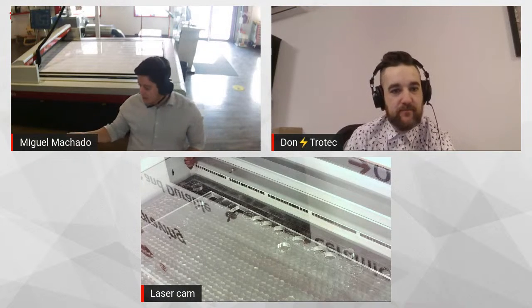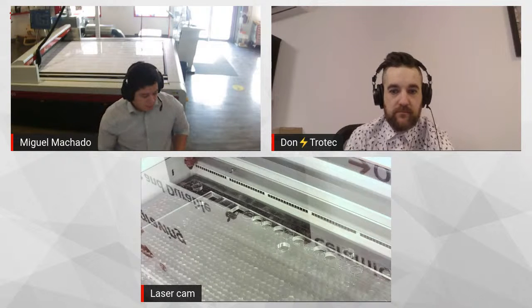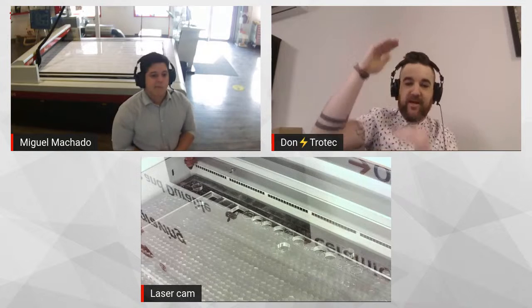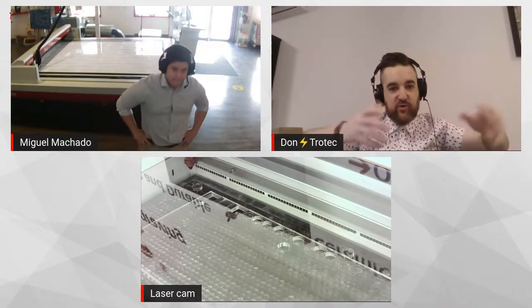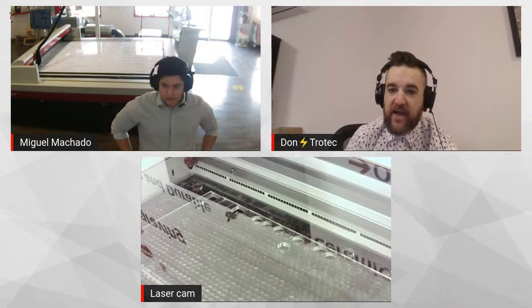If you're doing smaller, thinner acrylics, you should be doing that, right? With the 4-inch lens, it could look good. But 4-inch lenses are made for engraving in odd places, like inside of a cup or on a basketball, like we have some here. And this is a rotary tool to give you that huge spacing, the Z axis, the clearance. If you're doing a rotary object that has strange shapes, it'll enable you to engrave more easily across rounded objects and rounded surfaces. Exactly.